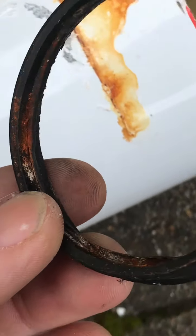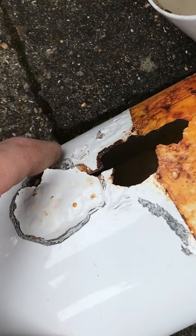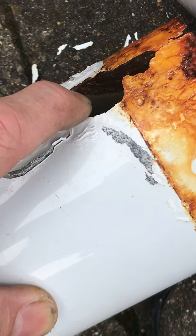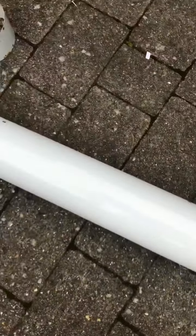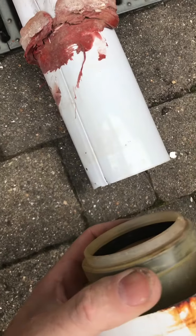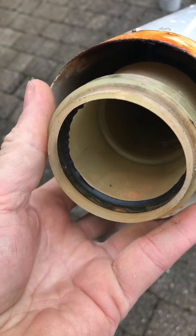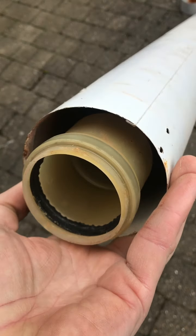This flue seal — you can see here the rippling. These go anyway. This is about less than 1mm thick. Steel rusts at 9-10 years per 1mm in one direction. Clearly, if this is condensate it's acidic. So what can we learn? Well, chamfering is your friend, and check your seals — because if you look at that weather and also hot temperatures, you can see it rippling there. You can get these seals — so that's all I'll say on it.